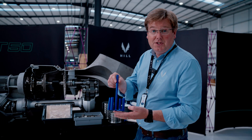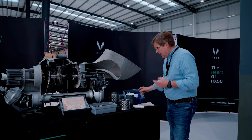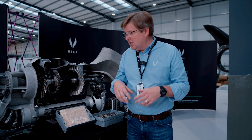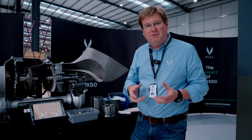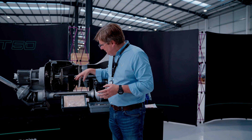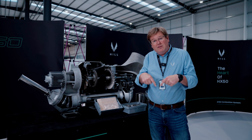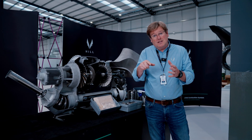This is just a simple example — the actual turbine blade geometry is a bit more complicated. In addition, we have to develop filtration materials to capture any bifilms, any oxides, any damaged shell or block material carried along by turbulent metal flow, and stop that from entering the blade cavity as it fills. We've been developing methods to produce these filters, entrain them within our wax investments, and get them safely into the mold so they're ready to act as a barrier to impurities getting into the turbine blade casting.